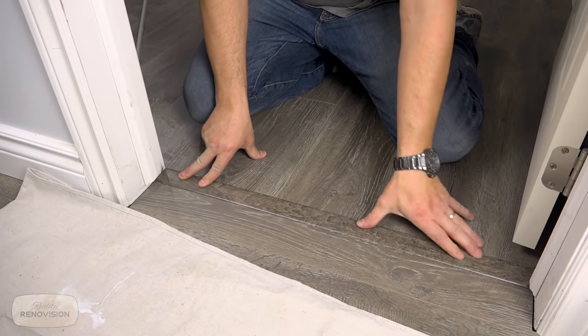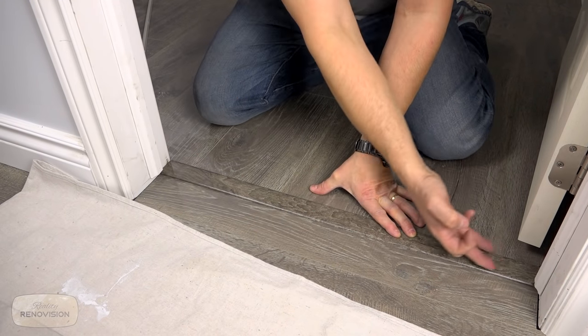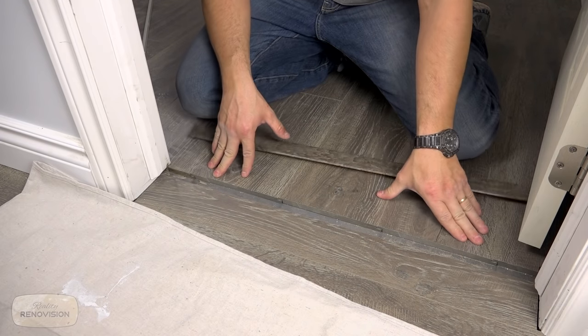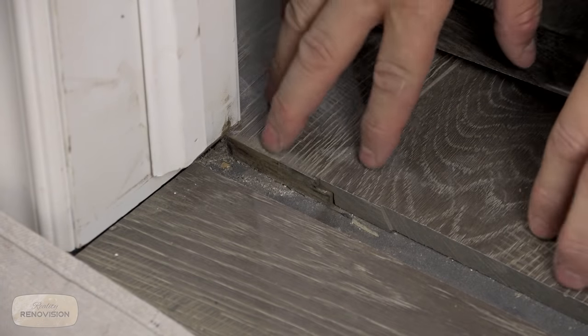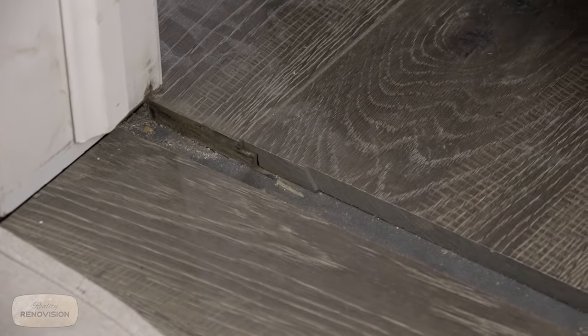like. You will notice that it is exactly underneath where this door is going to close to, all right? And the secret to that is installing your flooring just a little bit to the inside of the jamb and right under, just a little inside the doorstop. You really want to leave a 3/4 inch gap at the maximum all the way across.